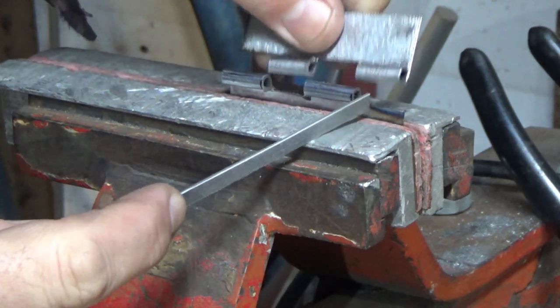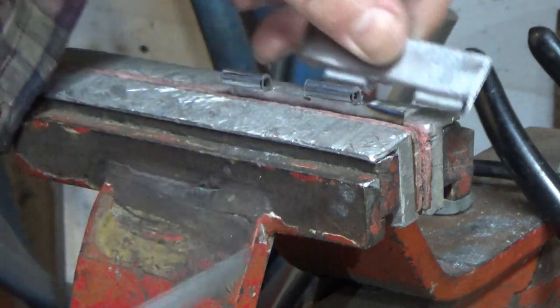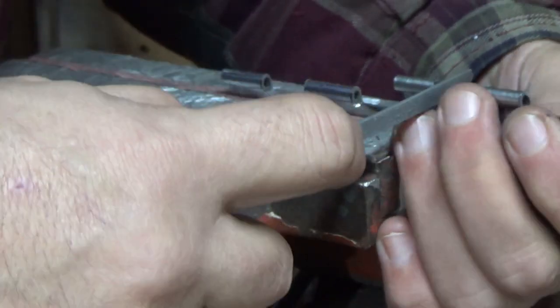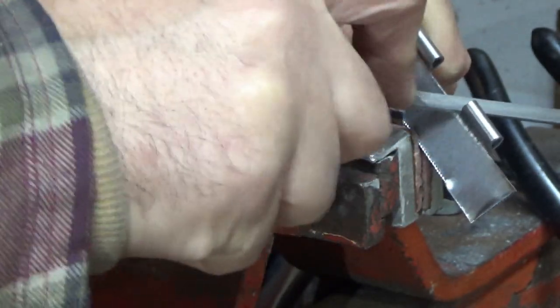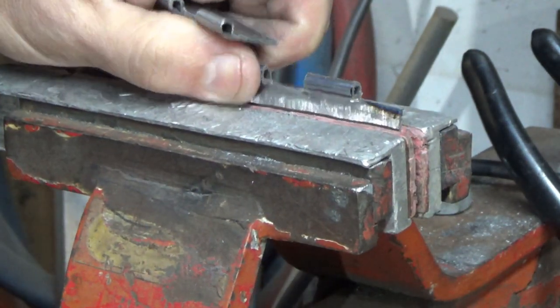What you're looking to do is be able to get that in there. As it starts to feed in - see, that's not even, not square. It's this bit here, it just needs a bit out in that corner. There we go, now I can see that's going in there. That's not square - see how that comes back this way? That corner bit needs taking out. Having these as square as you can is really important because then the hinge will move well. If there are angles it will still move probably, but just not very nicely. When a customer tries on your armour, the last thing you want is to be making excuses for stiff hinges.